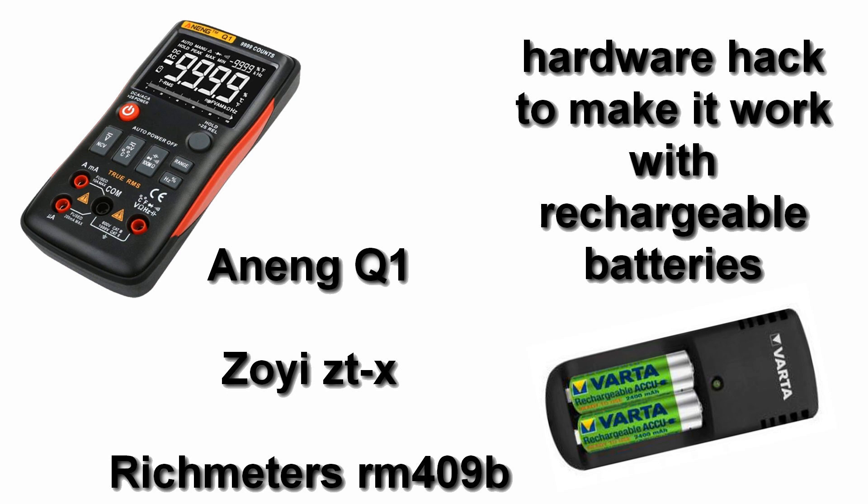It really needs three volts of operating power, so two AA batteries is what you can put in the back. But when the voltage drops around 2.5 volts, the low battery warning starts to pop up, and also the backlight — which is permanently on to give this inverse display — already starts to become a little dim. This makes it complicated to use with rechargeable batteries, because even if you have brand newly charged batteries, your voltage probably will not reach three volts; it will be around 2.5 or less, and that gives us some trouble.